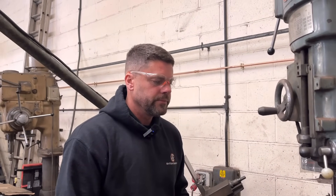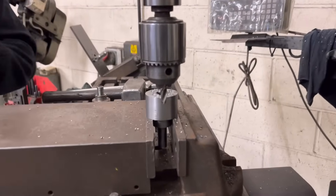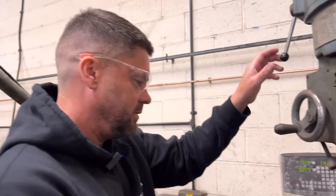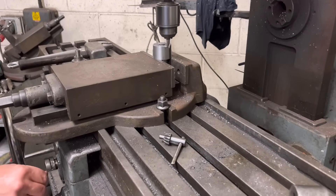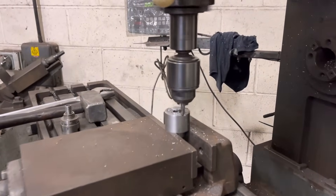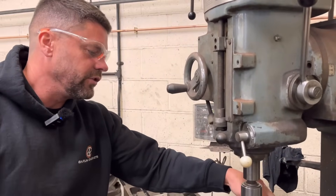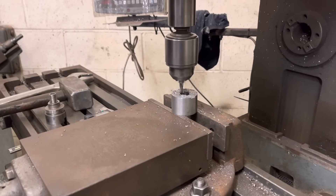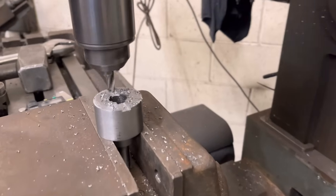I'm just putting a slot in it. We've got slightly less than 8mm — probably 5/16ths. I've got to go 8.5mm deep, doing 20 thou cuts which is half a mil — very conservative. We've centred it: what I do is hold this in the three-jaw, touch on the back, touch on the front, half the distance, zero it, and we know we've got the centre. That's how we make the drivers for the crank balance machine.